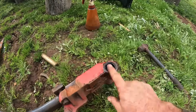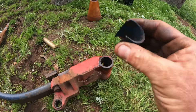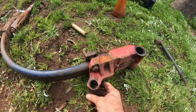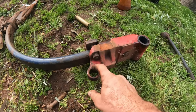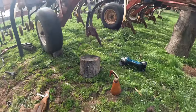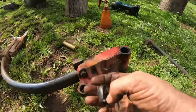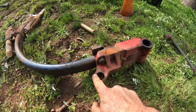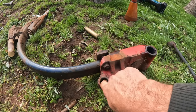Now we've got that pin out, let's have a look at the bits that wear. There are two bushes in here — these wear out really quickly. It's $1,000 a tine, and I think there's 24 tines on this machine, so it's $24,000 if you want to replace everything. That gets really expensive, so you're better off replacing your bushes. The first year we did this, the previous owner obviously hadn't done much maintenance. We welded up and ground out a lot of these — it is cast, but you can MIG weld it and then grind it back to the right sort of shape.